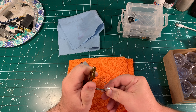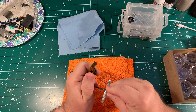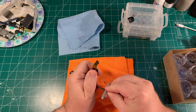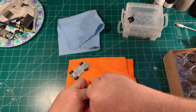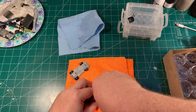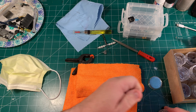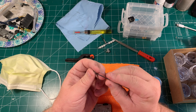If you're somebody who doesn't like to tap the drilled post out, this is a place where you really absolutely need to. Just trying to force the screw in and let it cut the threads greatly magnifies the forces and you stand a better chance of destroying your work. I highly recommend a nice good quality tap, a little bit of oil, and just go slow — tap it, back it out, tap it, back it out. Be gentle and cut the threads with the tap. That's going to reduce damage and lessen the chance that you'll destroy the work you've done, and make everything go together a lot easier.